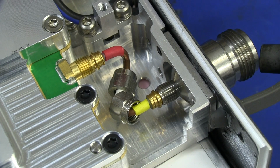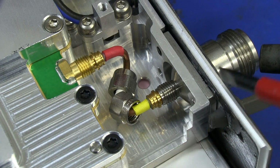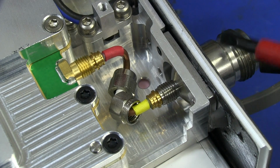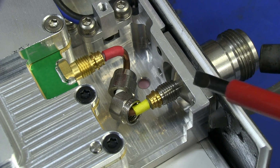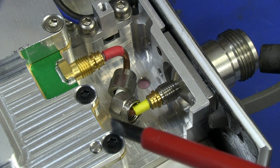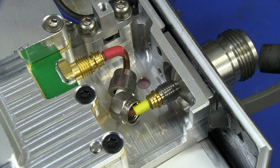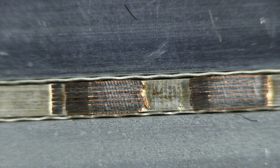One of the things I love about this construction with all the machined solid aluminium block is that this connector is not going to break off. You know, you get some heavy ham-fisted production or field operator or something like that, and look, it's just screwed directly into the full chassis of this thing. Unbelievable. And I love it when PCB layout people put these visual layer guides right on the side of the board. They just bring the copper right out to the routed edge. One of the dangers with that, of course, is that you can actually short these out.